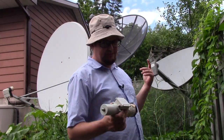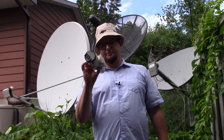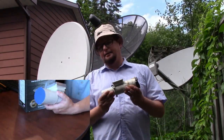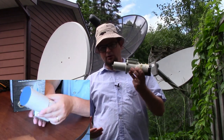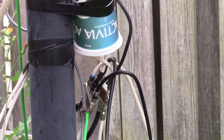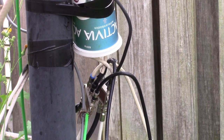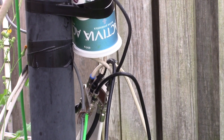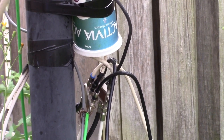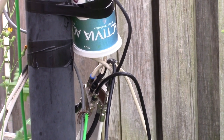An eight foot dish is good, better than the four foot. But a 10 or 12 foot dish would probably be a lot better. To give a comparison between this one and the Titanium C-1, I would say the titanium gets maybe a little bit better — it's not enough to set the whole world on fire, but it does get a little bit better quality than with this LNB. I was getting a lot better performance running multiple coax cables to the LNB, and I was able to get the KU band LNB to work a lot better using the DiSEqC switch instead of the 22K switch.